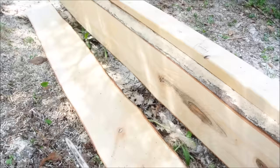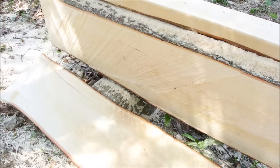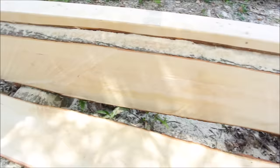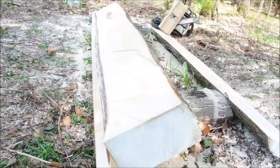This one went not quite as well. I was able to do a little better down here, but I had chain problems at the beginning, so I swapped out. I gave it a sharpen first — it still didn't seem to do well — then I gave it a new chain. Updated conclusions: this little chainsaw is too small. Yes, it can be done, but it's not very practical. You can do it if it's the only thing you have, especially on a smaller log, but maple pushes the limit. All told, this is a success, but it's not ideal.